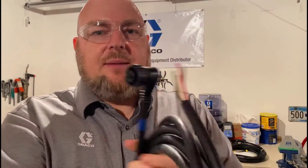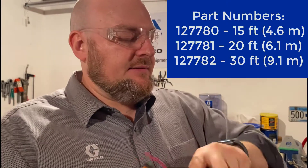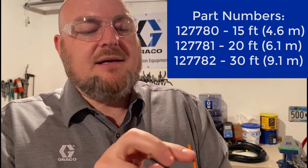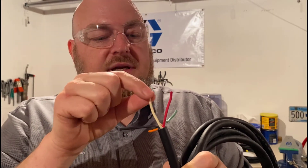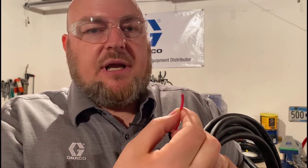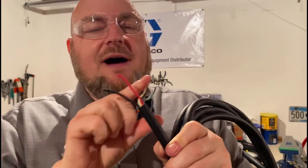The other optional cable is the five-wire cable. It has the same CPC connector but five different wires — including white and also red. If you only want to hook up to power and ordered this cable without the push button, you can just clip off the wires you don't need. With the five-wire cable, white is no longer your positive ignition line. Black is still your frame ground, but now red is your ignition power — again connected to a fuse and then to ignition power.